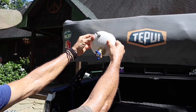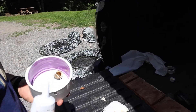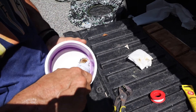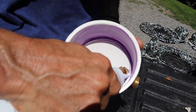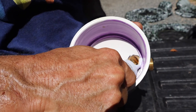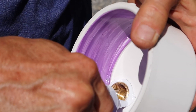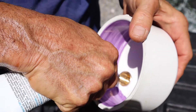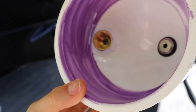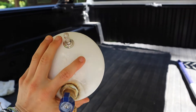We made sure everything is nicely lined up so that when it goes on straight, the nozzle will be facing down. Then we're going to put some silicone sealer on there, making sure it gets around the edges nice and thick so we can smooth it out and have a nice tight seal with no leaking. We'll be doing that to every single fitting on both end caps. As you can see here, the silicone sealer is all on the back and everything is ready to go.